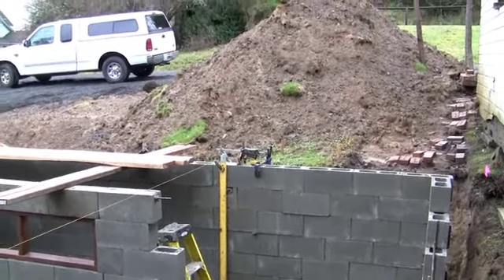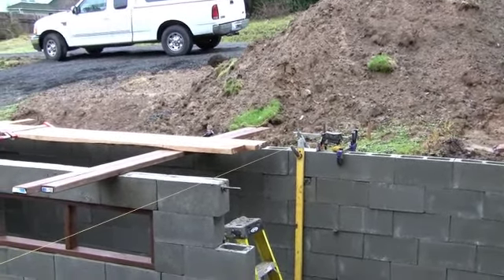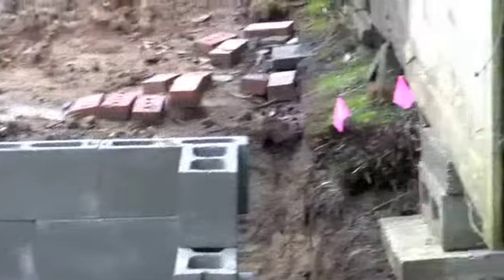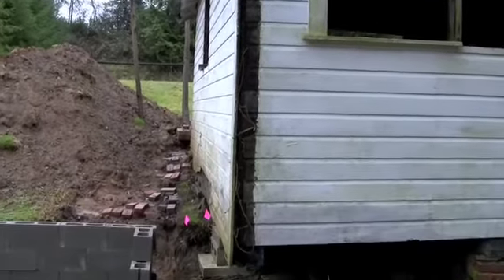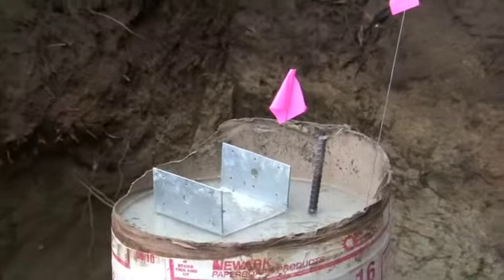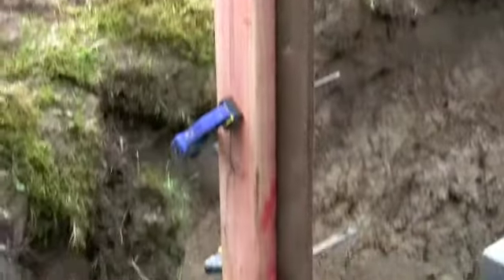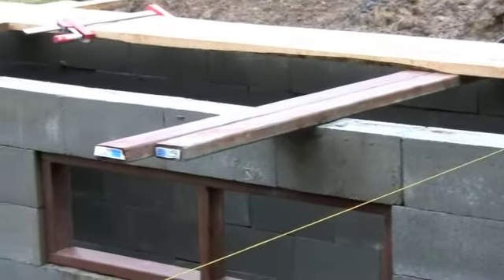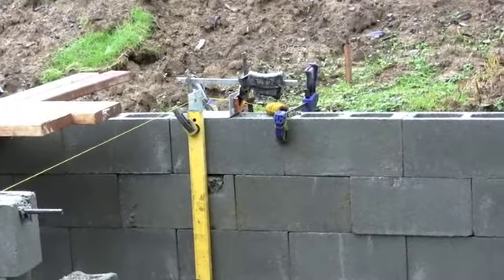It's been a busy couple of days and I've probably mixed 24 bags of either high-strength grout or pre-mixed concrete. This feature here is going to hold the six-by-six that will go underneath the front wall of the guesthouse. This point right here is 17 feet 2 from that point over there, which means this corner is exactly square. I came up with some scaffolding that allowed me to fill all the cells on the top couple of courses on this side and three or four on the other side — that's why it took so much pre-mix.